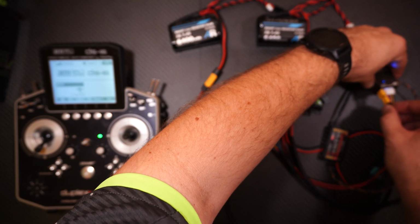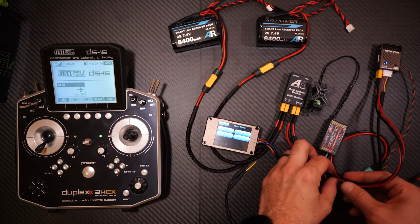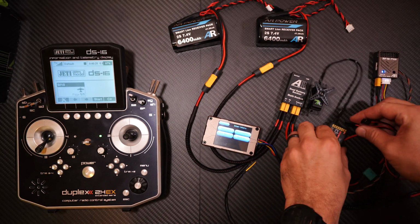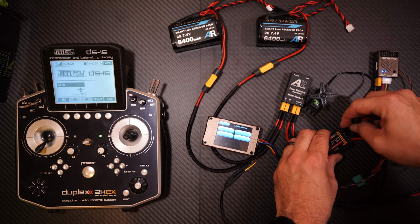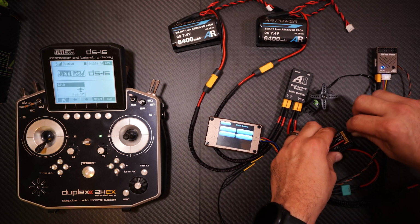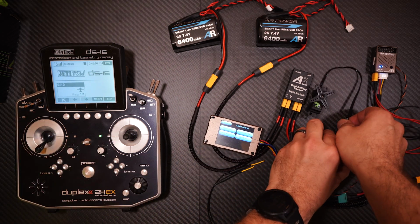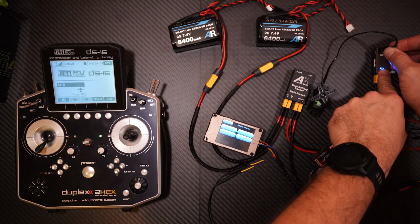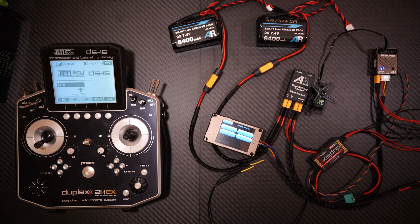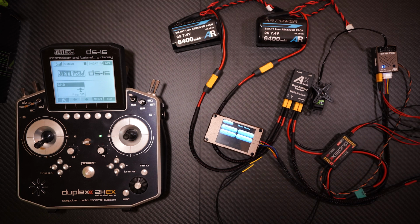Anyway, I'll plug in this cable here, which is the 2JR cable. And these can just be plugged straight into your REX receiver, into any channel that provides power. And now, demonstration, I have power on my servo, but I also have power on the SF10. Okay, so this is still a dual battery redundant setup. If you want to, you can power the SF10 Pro directly off the REX receiver.